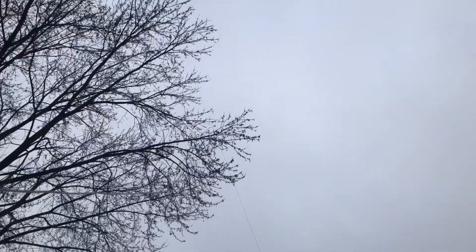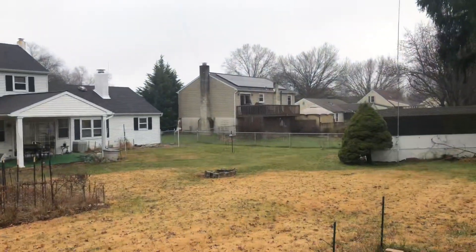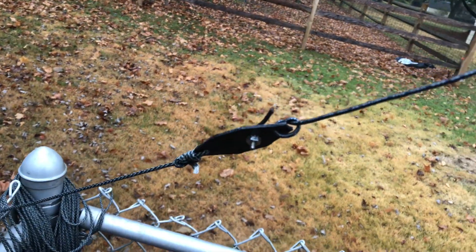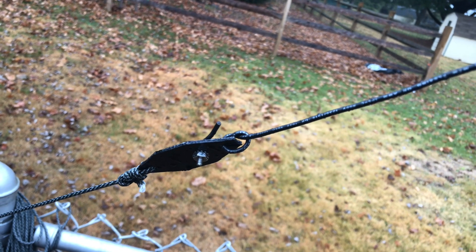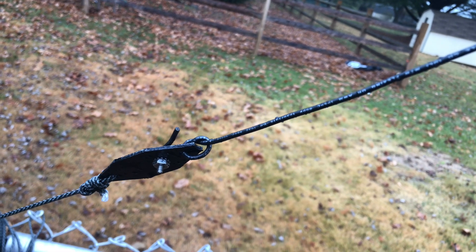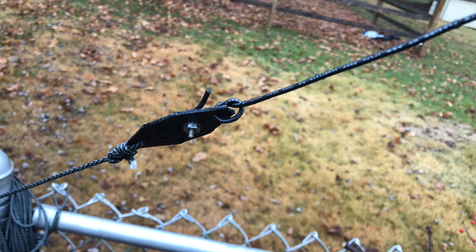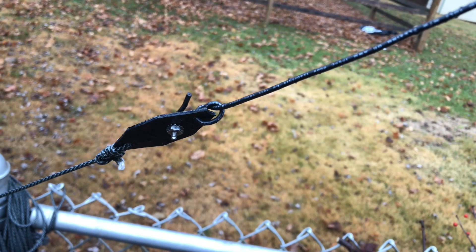As you know, it's going up over my tree inverted-V style and down at the corner there. It's 132 feet long. Over the last week or so I've tested this on low power, medium power, and high power. It doesn't matter — on sideband anyway, from 80 all the way to 10 meters, my SWRs are like 1.7 to 1.8 all the way across the board.